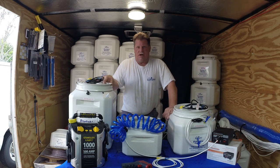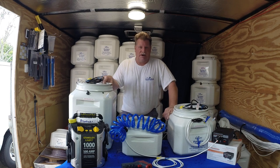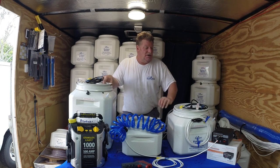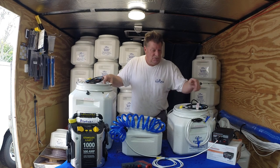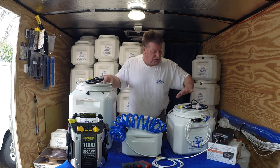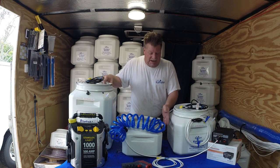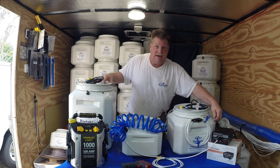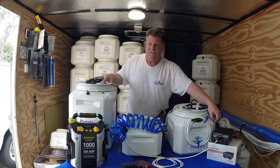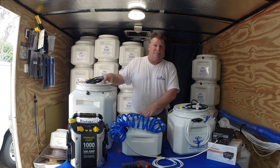The product is high quality. All the connections are done with dielectric grease, the plug is done with dielectric grease — nothing's going to corrode. All the components are marine grade stainless steel and aluminum. The fittings are nylon, not plastic, all done with Teflon tape. The container is an O-ring sealed Gamma container.